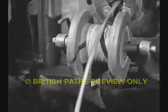The molten metal is charged to a lead press, which extrudes the lead or alloy under great pressure around the cable in the form of a seamless tube. Motor car cables are provided with several different finishes, and one of the most common is an armoring of a spiral of bright aluminium wire.